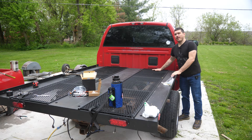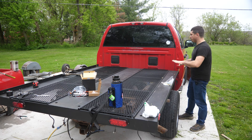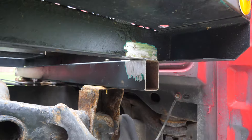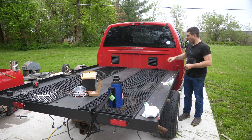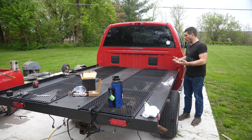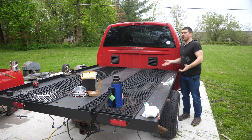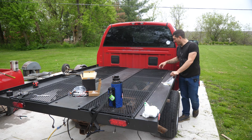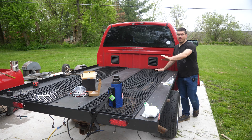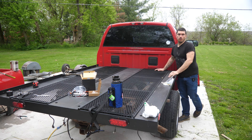We have all that cut. I threw a coat of paint on it because it's going to be a pain to paint once it's sitting in here. We lined it up, made sure everything was square, ground down where we're going to do our welds, and dropped the bolt through to line it all up. At this point I'm just going to take that support bar, tack it onto the trailer itself, and then either have Angel hold it up or flip the whole bed over so I can weld all the way around it. After that, we just throw the nuts on the bolts, secure it, and then line up the back and do the same thing — weld that one-and-a-quarter square to the actual frame, and then bolt the trailer into that.